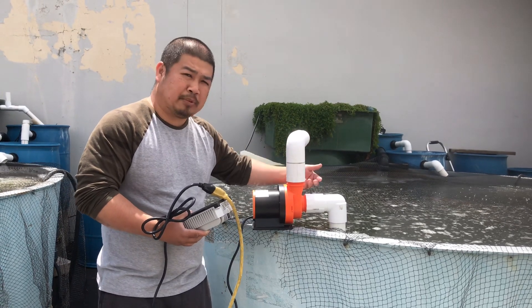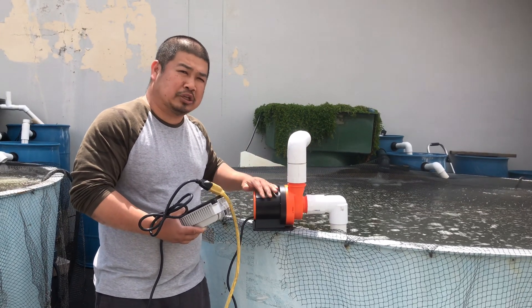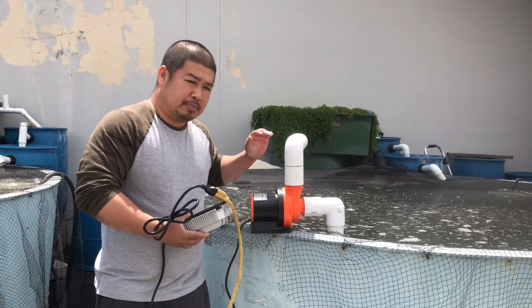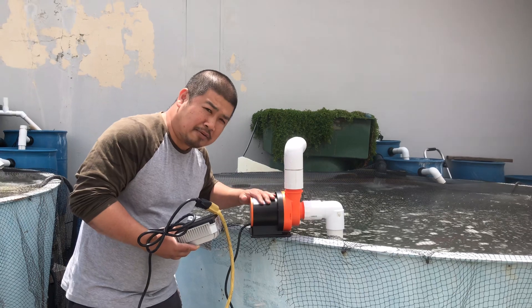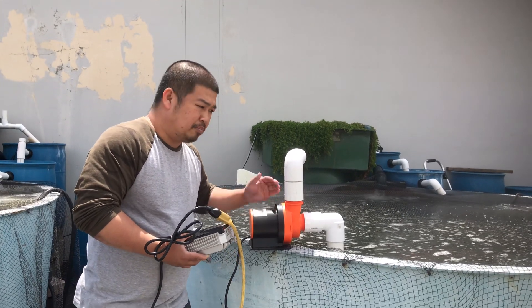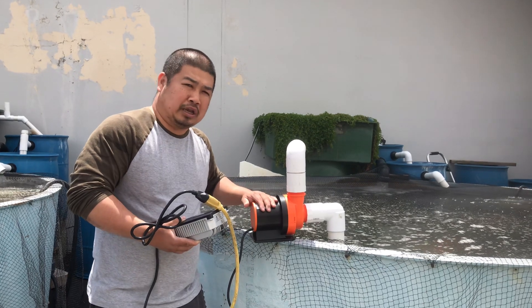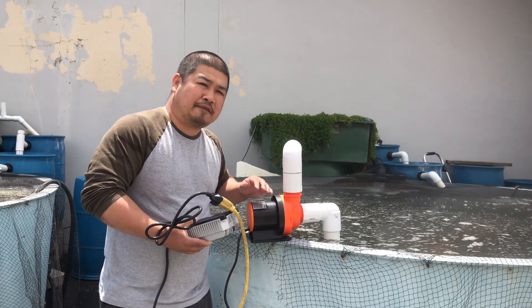Because the pump is trying to prime the water in, and it's too weak to do that. The water cannot go up. The pump is running — you can hear the sound — but no water. It doesn't mean that the pump is not working; it's that you need to have a check valve.